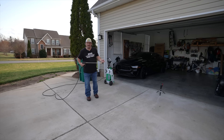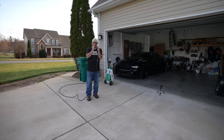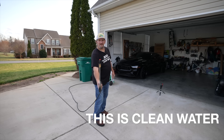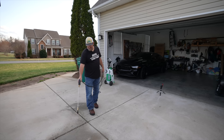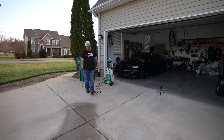Probably the single most commonly used nozzle or tip when spraying turf is going to be a fan tip. It comes out and sprays at an angle to the left and an angle to the right. We'll spray this straight up in the air right here so you can see that fan it's producing. As I'm spraying right here, it's creating that fan pattern, and as I'm moving, that produces your coverage.